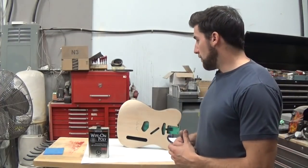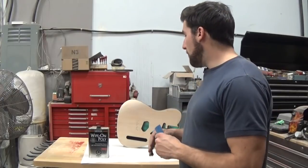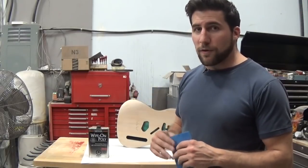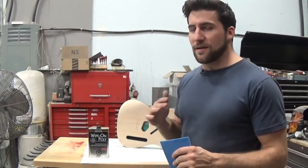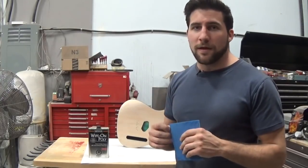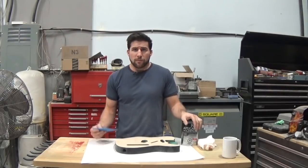The concept is fairly straightforward — as with most finishes, we're going to apply this in several coats. The trick I'm going to use is that for the first coat, I'm going to apply it fairly aggressively with some sandpaper. I've got 1500 grit sandpaper here, which is pretty fine. As I wipe it back and forth, I'm creating a bit of sawdust that gets into the polyurethane and helps fill in the pores and seal the piece up, so you get a nice smooth finish and avoid dry spots and sunken areas.